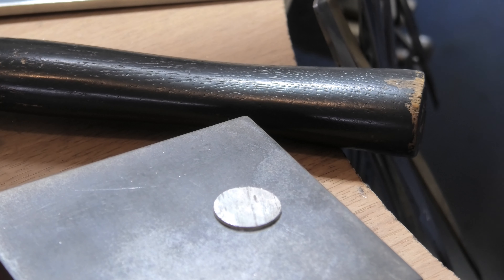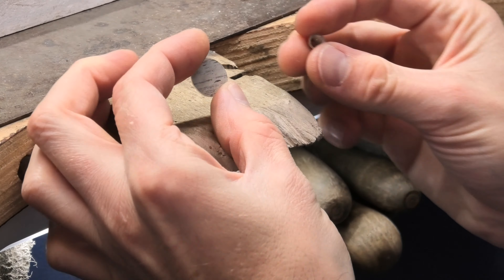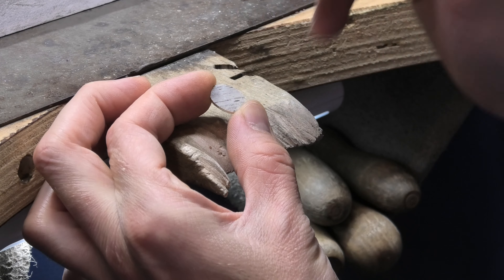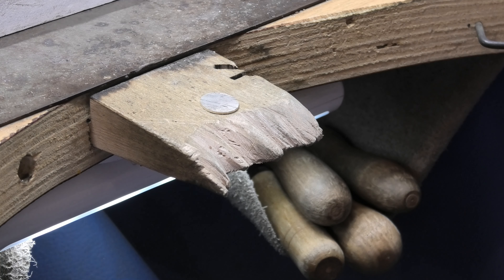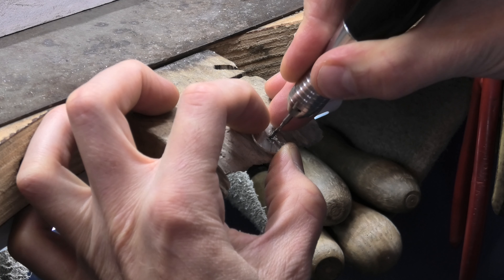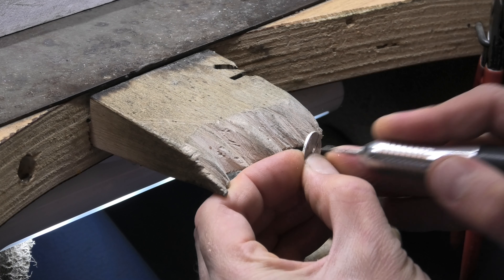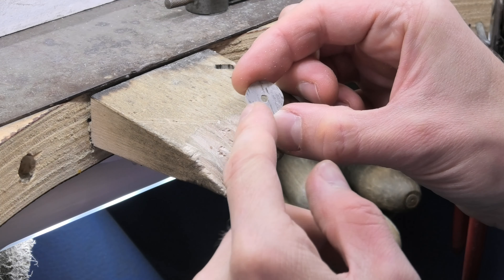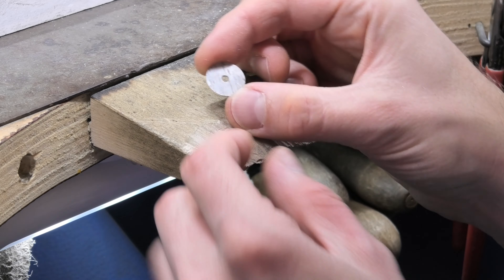Very little work to make a disc - I know you can buy them but making stuff saves money and it's good experience. I've got no idea what this is going to fold up to, but there's quite a small hole there so I'm just going to drill it out. I'm imagining that punch is going to go into the hole and open it up a little bit if this works at all, so I'll just drill it a little bit - just get it going with a nice sharp drill. Check out my 'how to sharpen a drill' video! I might open it up a little bit more. So I've got my disc, cut a hole roughly in the middle, I'll anneal it again and then start whacking it into the collet punch to see what happens.